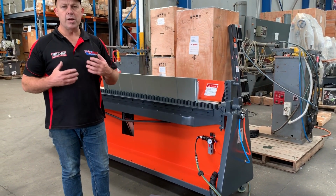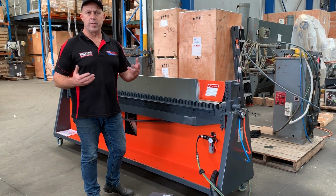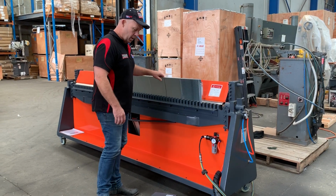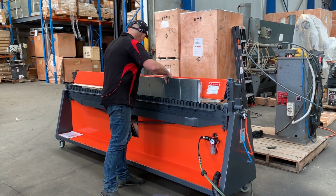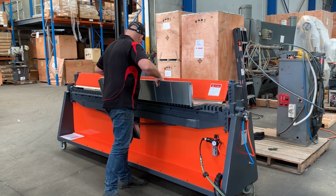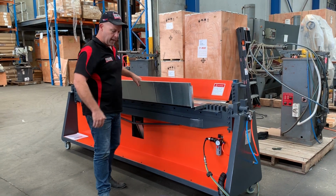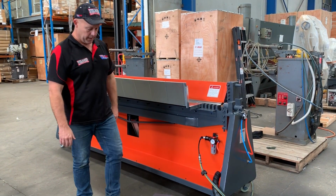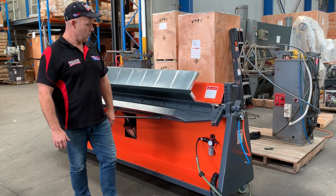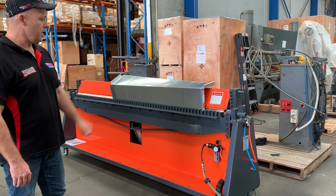So as you can see, nice and fast in operation, and that's what you want for pumping out that ductwork to meet those contracts. So we'll open it back up again, and bring this forward. And this one will actually wrap around the back. So we'll clamp this now, and then fold the second bend. How's that? So that's two sides of your HVAC ducting.